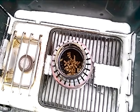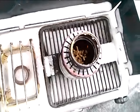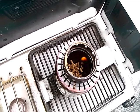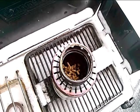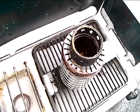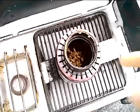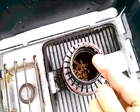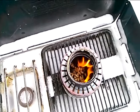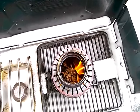I don't see myself making any more modifications to this one. You do see some flame starting up on the new fuel I put in there. If this were twigs it would catch a lot faster, but it's wood pellets — a lot denser, so it doesn't go up as quickly. You'll probably start to see some gasification again, and hopefully I can show you that vortex suction action as you see the flame coming up. There's suction going on right in the middle — it was sucking the flame kind of right down into the middle just at the end before the flame died out. That was a great opportunity to see the physics of what's actually going on in here.